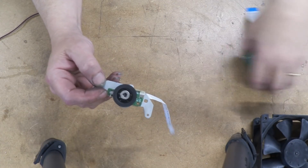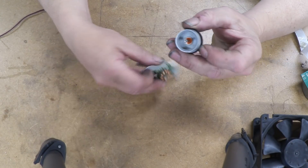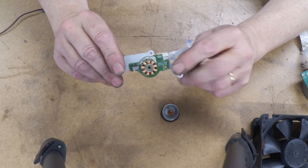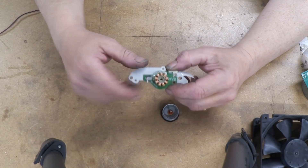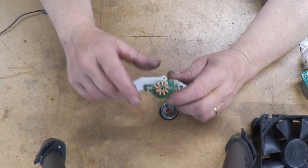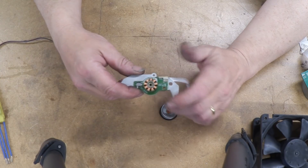Let's start with this one — the motor from a CD-ROM drive. I've done some CD-ROM drive videos showing exactly how to get this out. It pulls straight off, and in there is a ring magnet — the permanent magnet that the electrical rotating field acts against. There's a little star shape where the coils are. I can see one, two, three spots of solder, telling me this is a delta configuration, so I don't have to identify a Y center point. If we solder three wires to those spots and connect them to the speed controller, we can get that motor to spin.